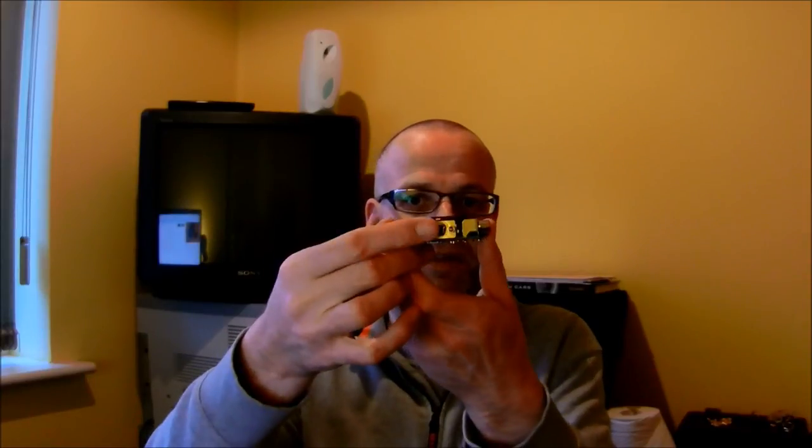This device is purely plug-and-play — you just need to connect your VGA or D-sub 15 from your PC into the D-sub 15 input on the device, and there's a SCART output that goes from there to your TV. Give it five volts power and it will work.